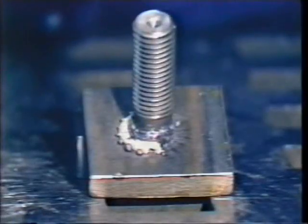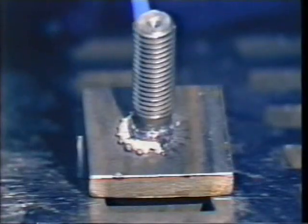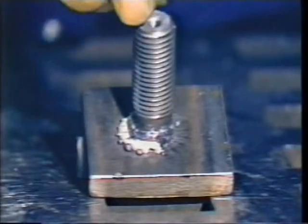These cold welds may result from not enough amperage or time being too low. The lift could also be short — the same amperage over a short arc length gives you less heat than the proper arc length.